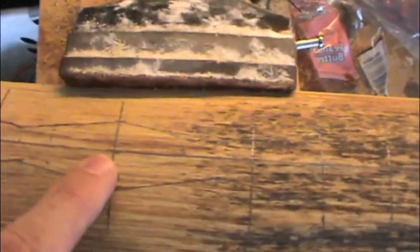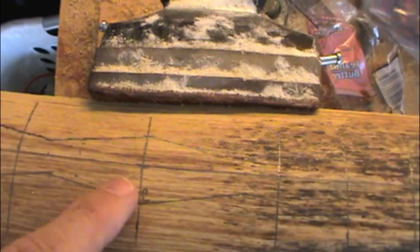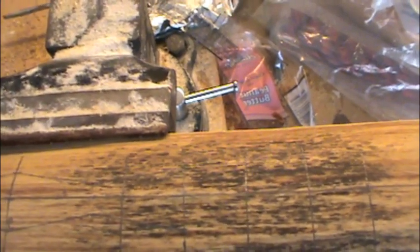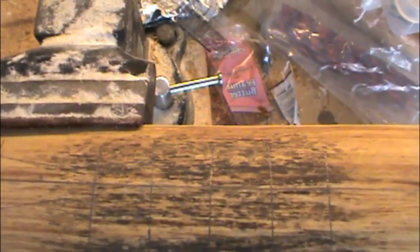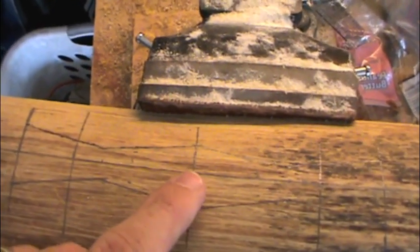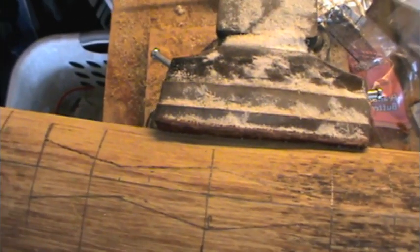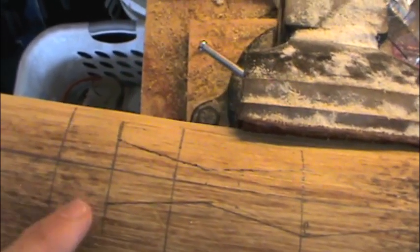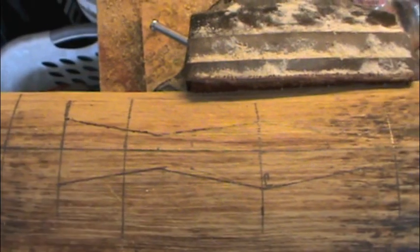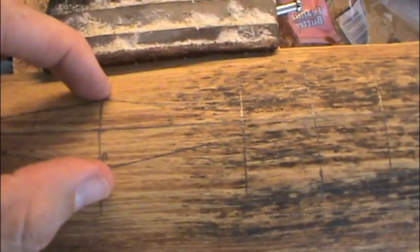And what I do from the center line is make the center line across it, and then every 2 inches I put a line across the bow. That way we can keep the width equidistant as we go down the bow. With a straight pyramid, it's not as big a deal. I've got 25 inches from the center on either end for either limb, and then I marked a cross line every 2 inches, except for here at the handle because of the dimensions I'm going to make on this handle for him. The bow's only going to be 1 inch wide here at the center.